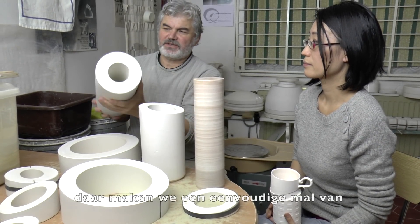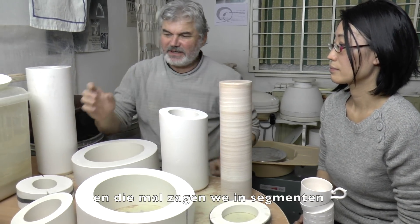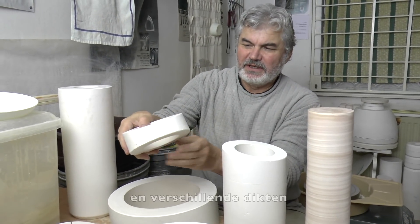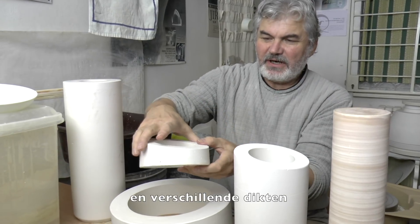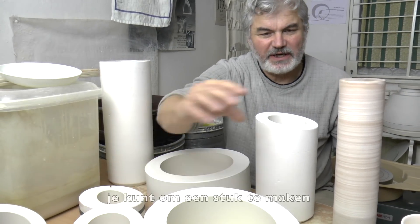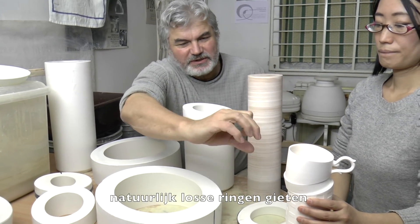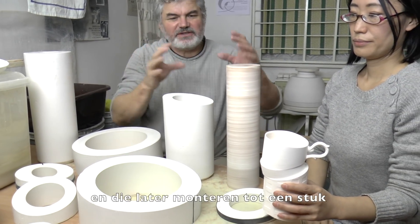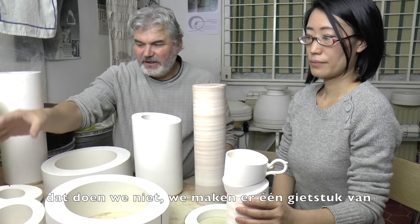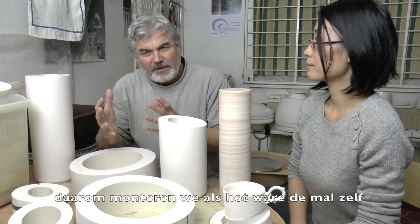From that we are making just a very simple mold. The mold we are cutting into segments which have different angles and different thickness. Then we are assembling the mold from these segments to be able to cast it all in one single casting. It's possible of course to cast some rings and assemble them together, but this is not our way — we want to make it in just one casting.